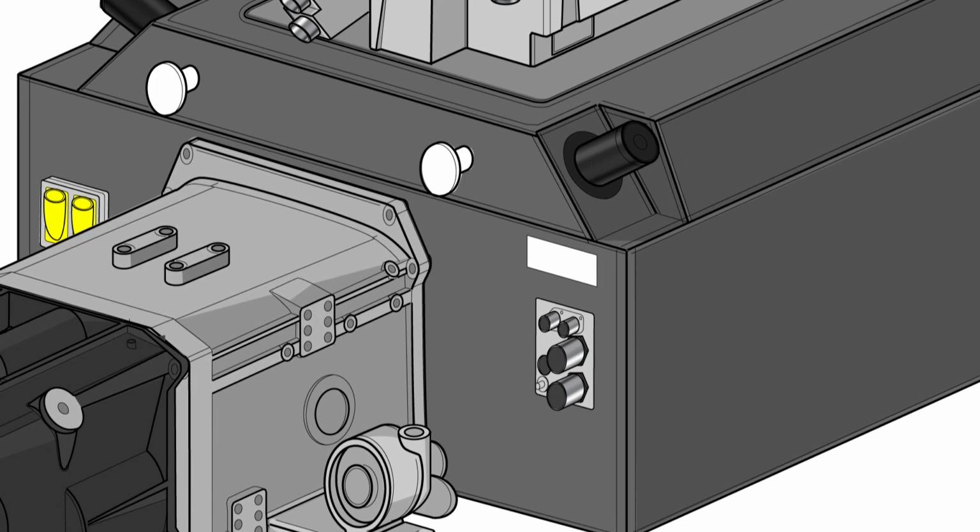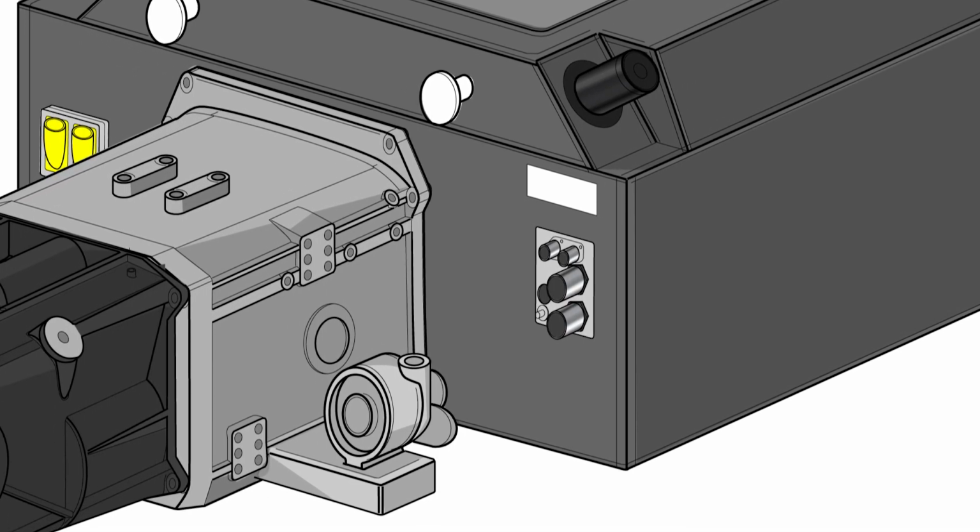This is the Season 1 setup, so this is now McLaren hardware. And that takes the DC power from the battery and converts it into AC for the synchronous three-phase permanent magnet motor, which sits inside the bell housing. And teams now are able to change all of these bits themselves. So some teams like to have a smaller motor that runs at very high RPM that needs a gearbox to increase the torque out to the rear wheels.